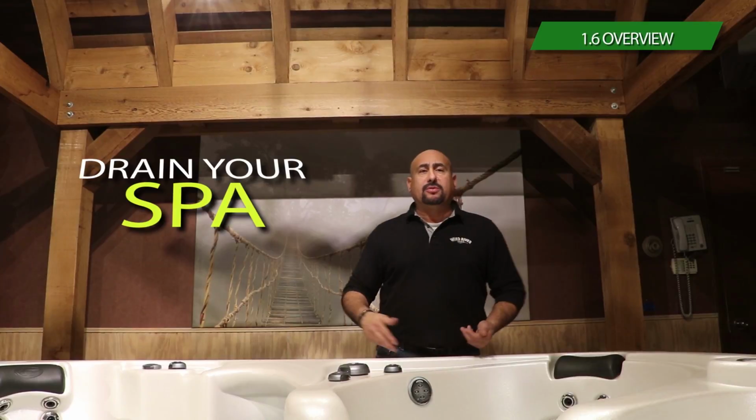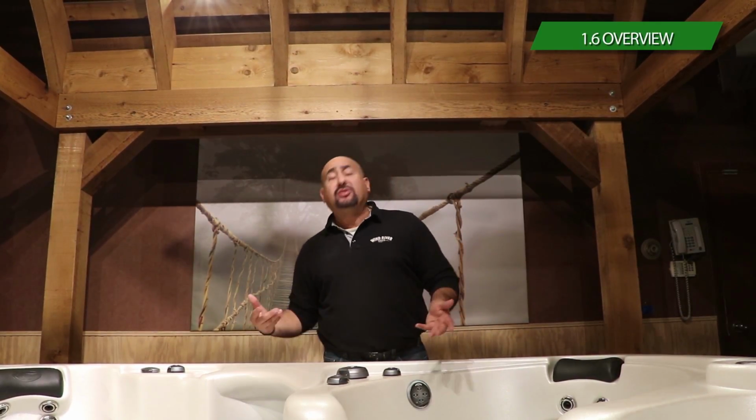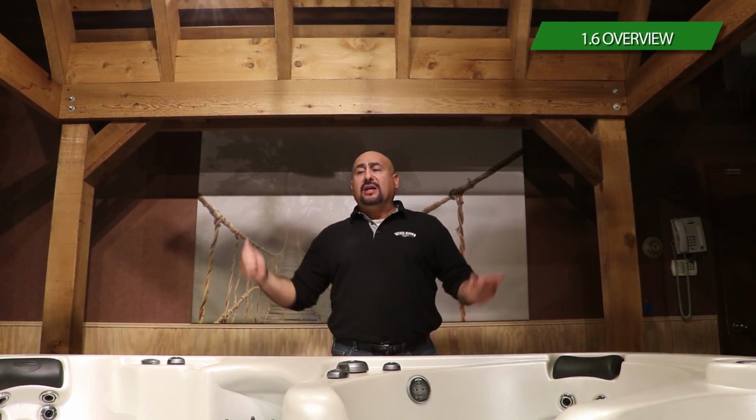Also, you have to drain your spa. Most of our customers, about every 6 months. If you don't like to do it every 6 months, at least once a year. But on average, we try to do it in the spring and then right before the winter months. Don't try to do it when it's 30 degrees outside. We don't recommend that. Another key thing is never leave the tub empty. Empty tubs, you get freeze damage, dry rot, there's so many things.